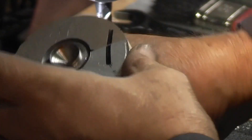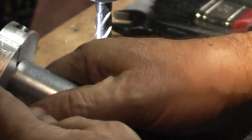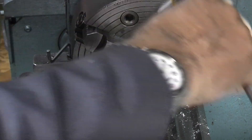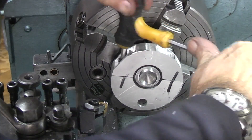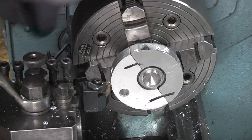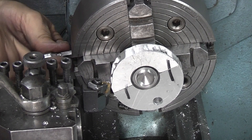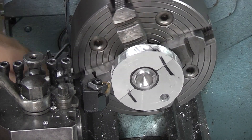This is the 30mm bar of steel that's just clamped to it, so now I can put that back in the four-jaw chuck and just tidy up the outside. What I've done is hold the 30mm bar in the four-jaw chuck and I'm gripping the clamp I'm making onto that bar. I'm slackening one side off and tightening the other side up. The reason I'm not using a dial indicator to true the part up is that the surface is too rough to get a decent reading.